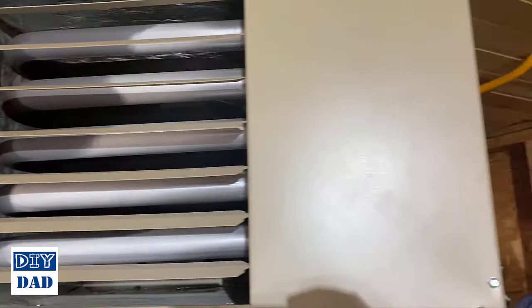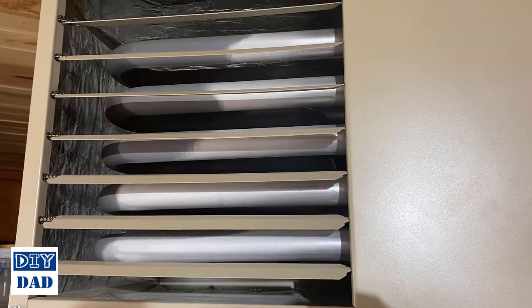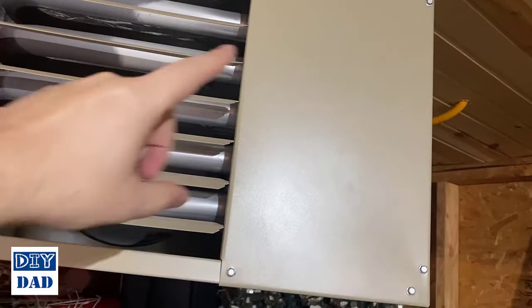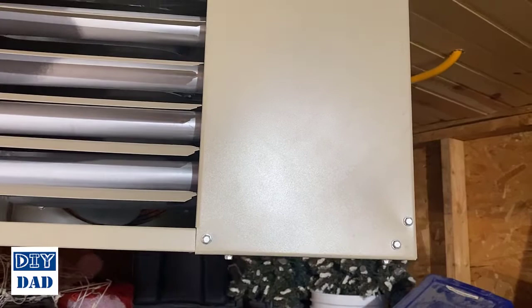There are a couple of safety features. I'll take the cover off so you can see — inside there are three main temperature sensors in a furnace like this. There are two rollout sensors and one high limit sensor. The rollout sensors look for heat showing up in the cabinet area. If your exhaust is blocked and air is pushing back in, it can cause the flame to roll out into the cabinet instead of shooting into the tubes — a very bad situation that will cause these sensors to trip.